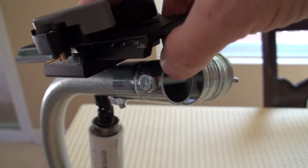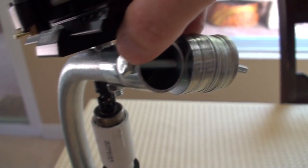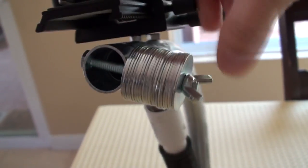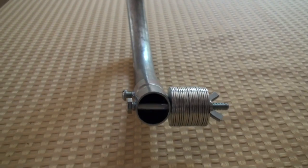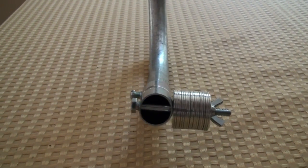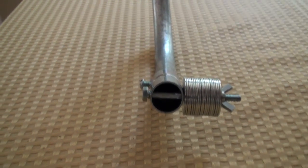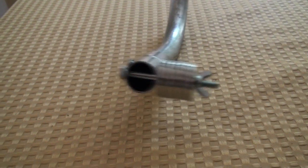The ones I bought at Home Depot — quarter-inch hex screws just don't go in that easily and you have to actually screw them down. There are my washers with butterfly fastener, and same thing down below. You'll notice that I've offset these to the right. In the case of my Canon T5i, when I open up the LCD display to the left, it really changes the balance quite a bit — it's crazy how extending something so light makes such a big difference. So I just have to add a couple of washers to make things a little bit more balanced.